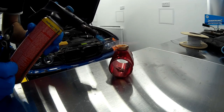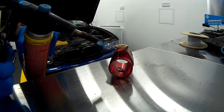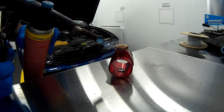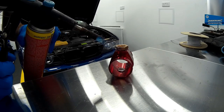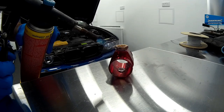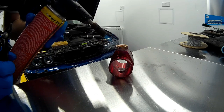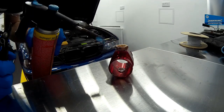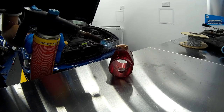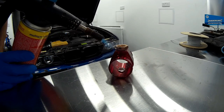These how-to videos show you most of the steps you need to take. It's taking a while to warm up — as expected, because you've got to heat the aluminium up as well as the brass. Brass and aluminium heat up at different rates and therefore expand and contract at different rates. The aluminium will cool down quicker than the brass and contract onto the solder and the brass bushing, then once the brass bushing is fully cooled down it should hopefully be a perfect seal. As you can see the flux is starting to bubble, so it means it's getting warm — time to break out the big guns.